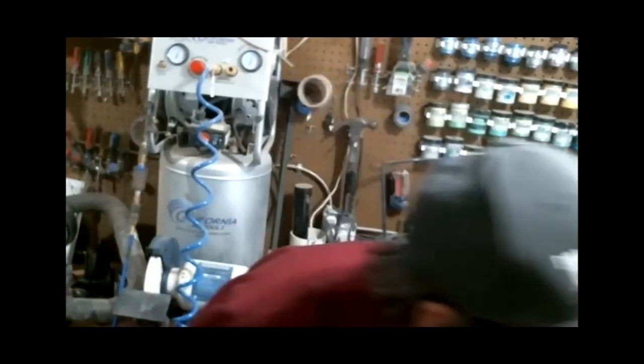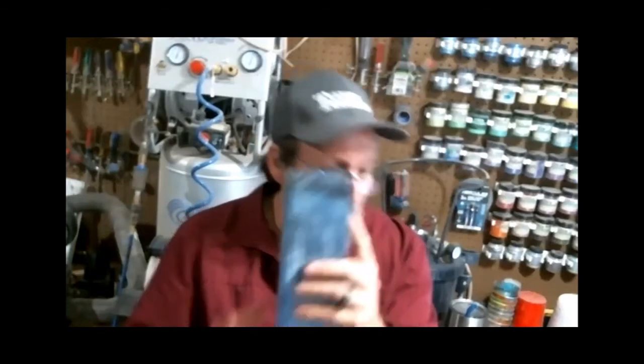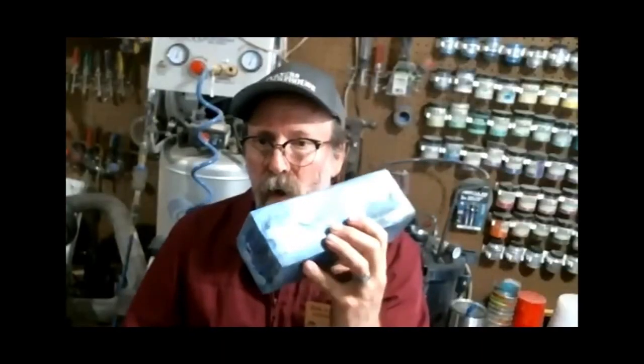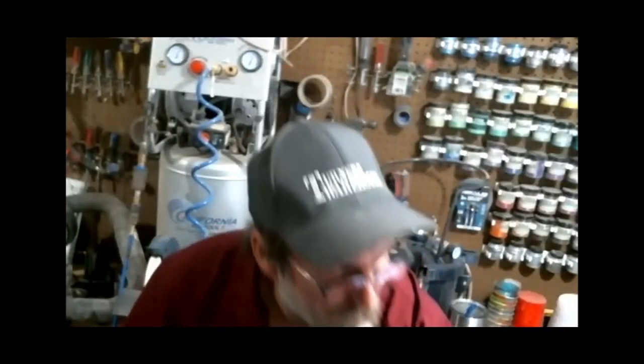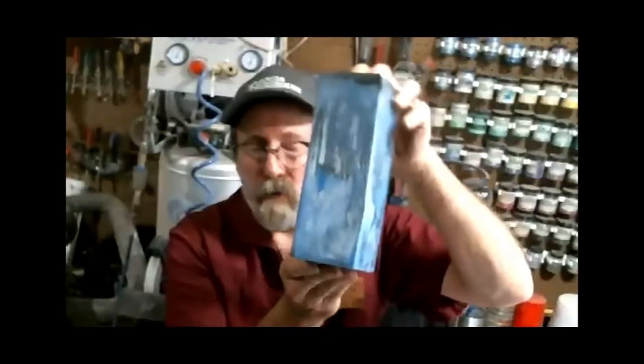When you're casting your pieces and you pull them out, they have a skin on them. So this has a skin on it. It hasn't been trimmed off. I guarantee you that if I was to trim it off, it wouldn't be this color, it would be blues, and there was going to be all kinds of detail in this blank. So you can't go by what's on the outside. You'll never tell what's inside of this until you actually cut into it. So I cast all our blanks in bigger blanks, and then I trim basically a 1/16 off of every side so that you can actually see what's inside. This could have burl hiding in it, and I would never know it until I trimmed it. That's that skin that gets on it, so keep that in mind.